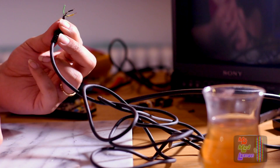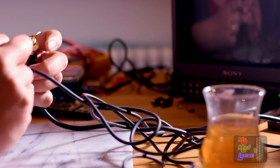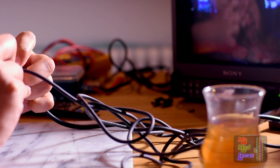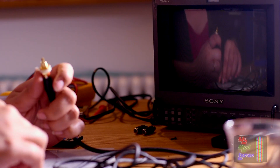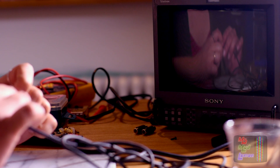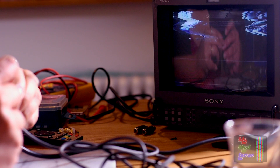So I'm assuming the other one — what are you going to tell me? That this ground is not right? What about this other ground? At least black is ground — that's one thing that's consistent. Oh, that's much better — that's a much better signal. Composites are always yellow. Yeah, so the thicker cable is video, and the other one's obviously going to be audio because it's got a wiggly signal.